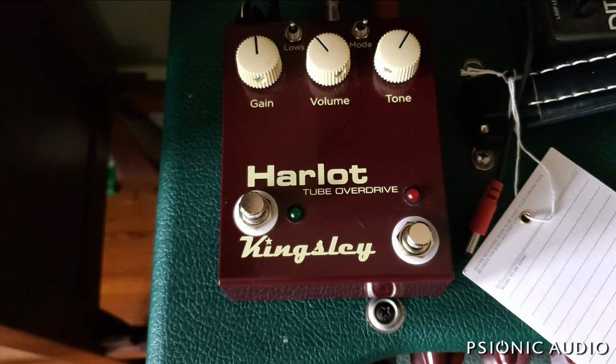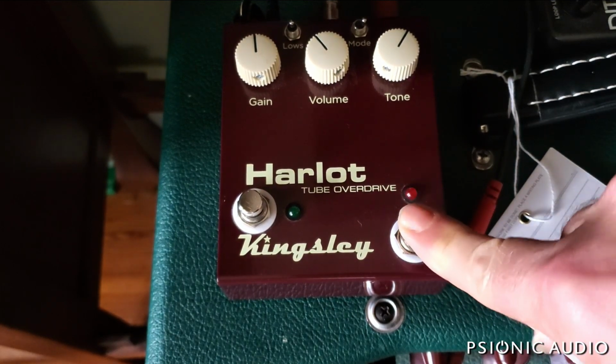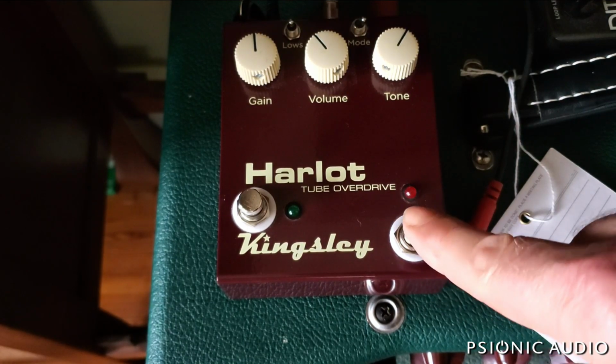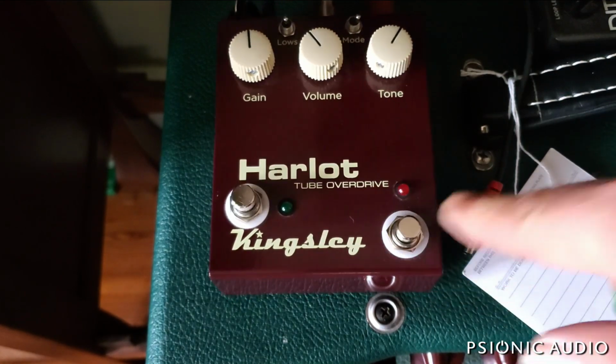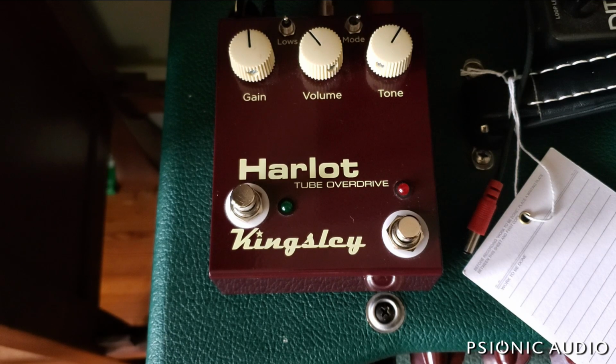And I just want to report back that with the new switch, that popping is gone. I mean, there's the acoustic sound of the switch, but there's no pop or click coming through the amp the way there was before. So if you see the previous video, that popping and switching was the faulty switch, not a circuit flaw.